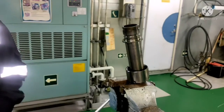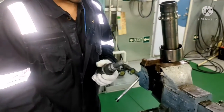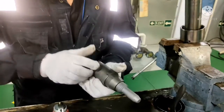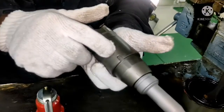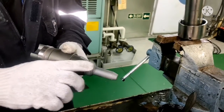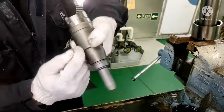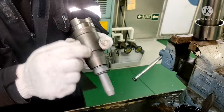Next thing is, you have to fix your spindle guide. Before fixing, ensure this is your slot. This slot should match your valve body pin. That means if it matches, this spindle won't rotate. If it is in the slot, it won't rotate. That is the idea of having a slot over here.